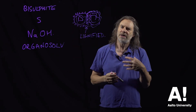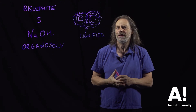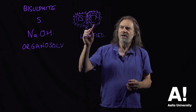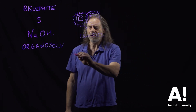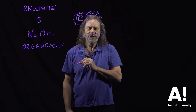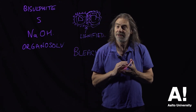Cardboard has a much higher lignin content in the cell wall because you want the stiffness property that lignin gives. Whereas office paper has much lower lignin content, so it's pulped for longer. But nonetheless, there's still some residual lignin in the cell wall when you finish the pulping process. So that means you then have to go through what's called a bleaching process, and I'll be talking about bleaching later in another lecture.